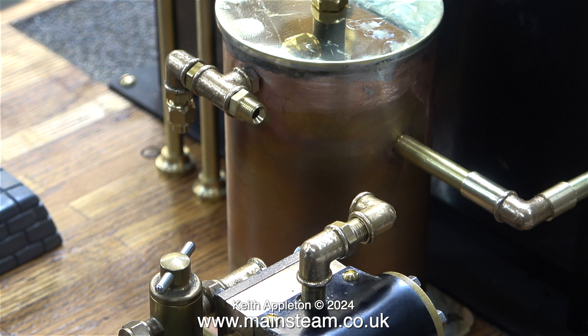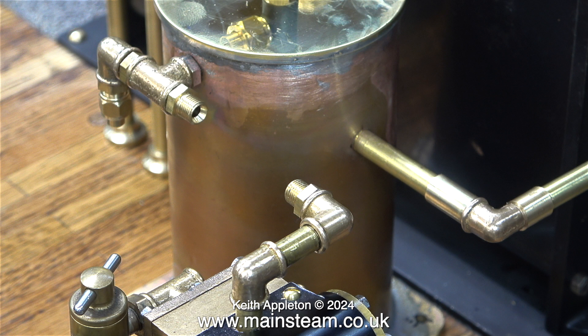Using a short piece of PM Research brass pipe, two PM Research cast elbows, and a double union, I've made a connector to join the engine to the T-piece. As usual I re-threaded yet another cast elbow the way I've previously shown. Once I fit a second double union in place, all I need to do now is make a piece of copper pipe with two union nuts on the end and union cones to fit between this gap.